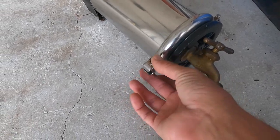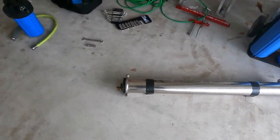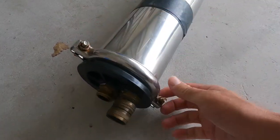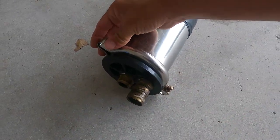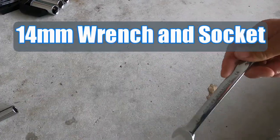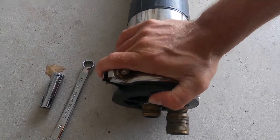Keep in mind, these you have to put on. There's a little ring here — you just connect them together and through the bolt. Once you have the black caps on, which is your inlet and your outlet, you're going to want to take your brackets here. There are two bolts and two nuts. You kind of see that they can only go one way. You'll tighten this with, I believe, a 14 millimeter wrench — you're going to need one on each as you're tightening it. You just want to get it nice and snug because this is pressurized, so you don't want any leaks.